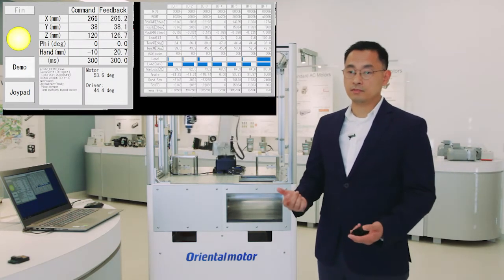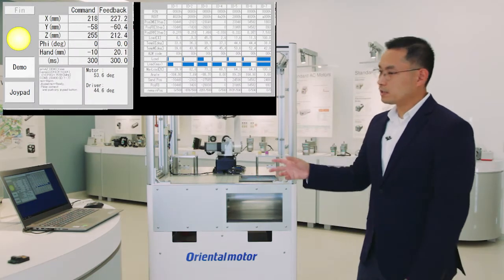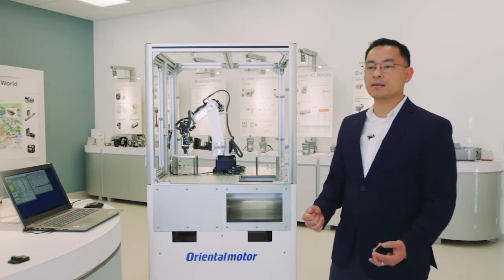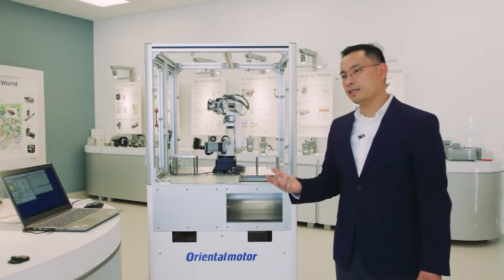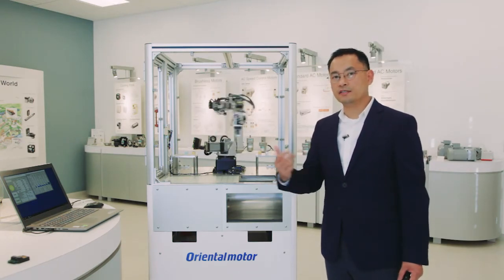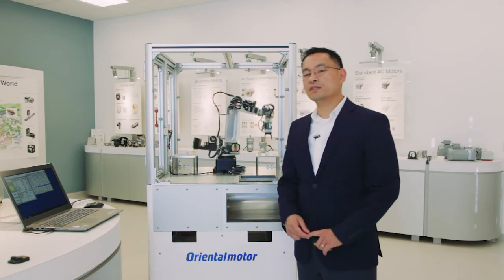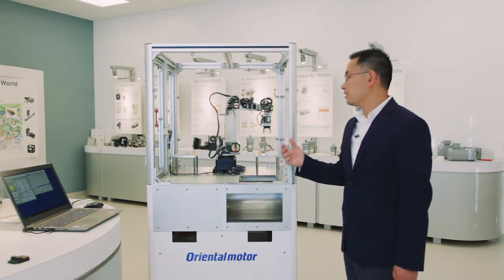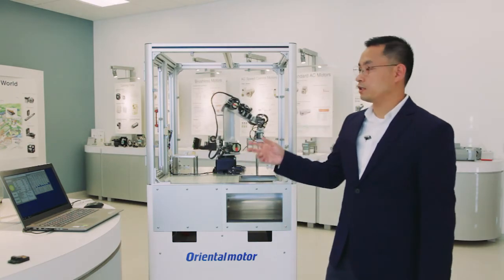Or something abnormal may be affecting the load. These motors should last over 5,000 hours under normal operating conditions. Once these conditions are triggered, you can start to take action before it's too late. This is just one example of the many available parameters. We have over-voltage and under-voltage — over-voltage can indicate an unstable power supply and lead to drive damage, while under-voltage can cause performance issues in terms of motor losing torque. We also have overload time, over speed, and trip meter, to name a few. The benefit is you don't have to track these yourself — you can use our free MEXE software to set your limits and the drive will self-monitor, letting you know when those conditions are triggered so you can take action accordingly.